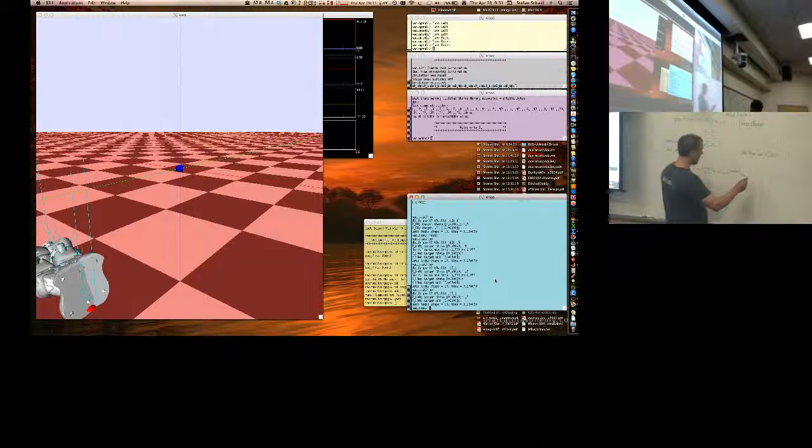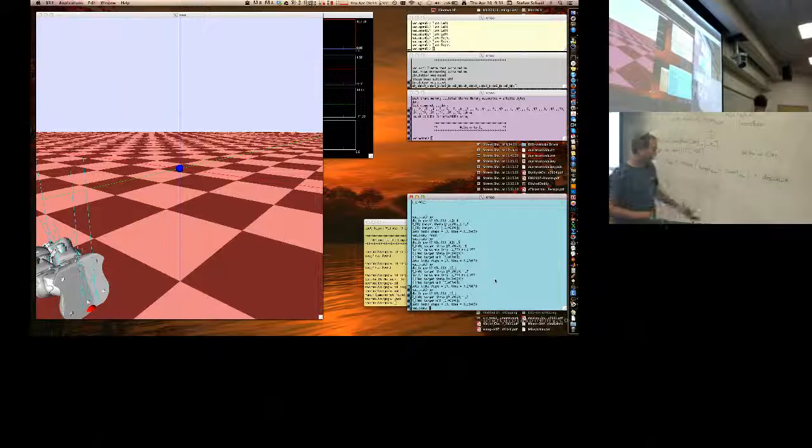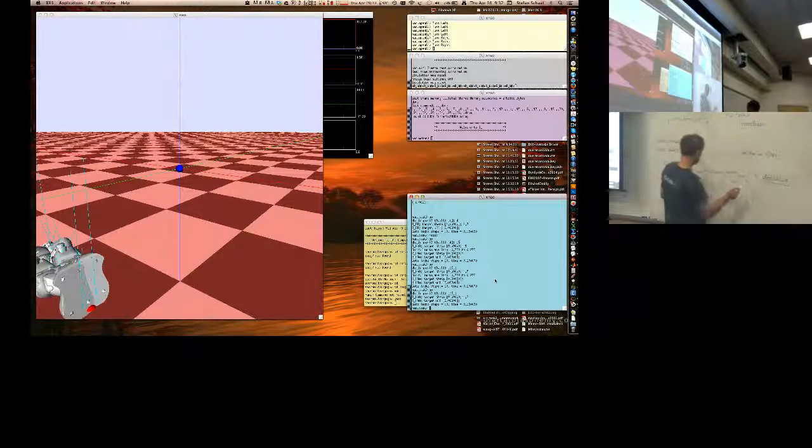And if you happen to have a target velocity, let's call this movement velocity. Not good, call it desired velocity. Okay? So if you have planned a trajectory for the center of mass, that means the center of mass is currently at a current position, you want to go there, you can plan a minimum jerk trajectory in 3 dimensions, x, y, and z, in external space, to get there. And that would give you desired positions, desired velocities, and even desired accelerations over time.